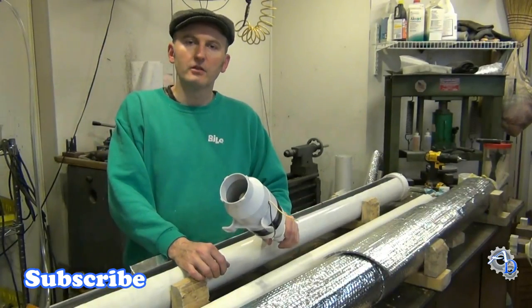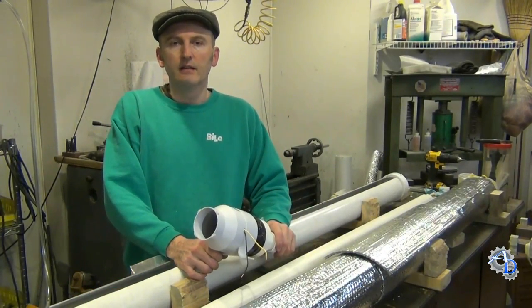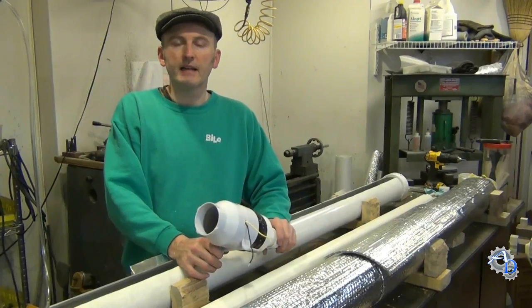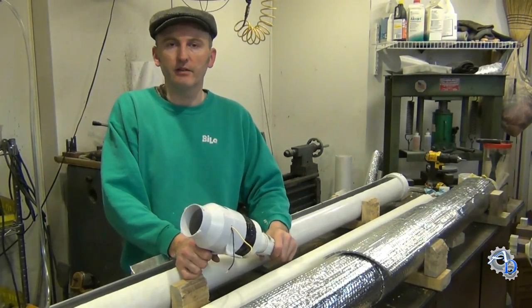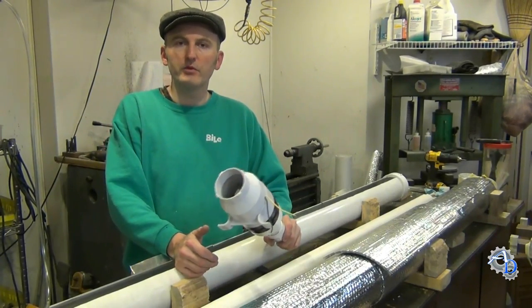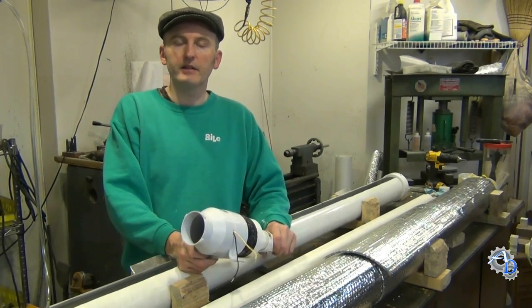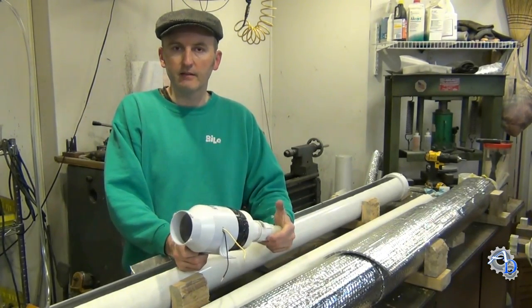Anodizing uses low concentration sulfuric acid for the electrolyte. I am running an air agitator, which bubbles air up around the part, and that's used to dislodge hydrogen bubbles so you get a better formation of your anodized layer. The problem with that is when you bubble something through sulfuric acid, it evaporates into the air, and then you get sulfuric acid fumes into your workshop airspace.